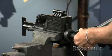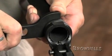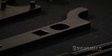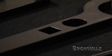The barrel nut and receiver extension nut are unique and require special tools, so running down to the hardware store just won't work. These tools are designed to fit other types of fasteners that you use on your rifle, so they also eliminate clutter on the bench and are handy to take out in the field. They also have a half-inch cut in them to accept breaker bars and torque wrenches, so you can accurately torque your barrel and receiver extension nuts.